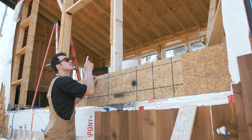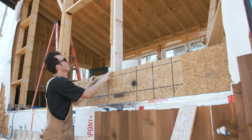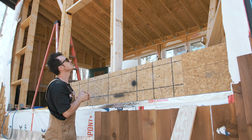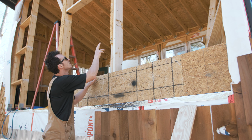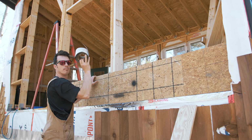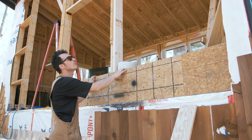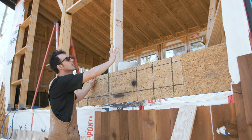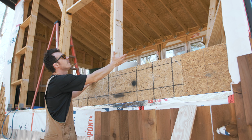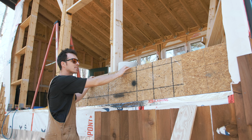All right, I need more 2x6s to continue framing out that portion of the wall. But this wall is pretty much good to go. I just gotta put a little bit more OSB on the front facing portion so everything's the same width or thickness. So what I can do now is get the OSB all trimmed out, or scabbed on, I guess you'd say, and then I can put my window flashing on for like the 10th time. As soon as I get the window flashing on, all I gotta do is put up my pressure treated exterior trim that is gonna keep all the windows in, and then this thing is ready for glass. So let's try and do that today so we can get some glass in this weekend. Woo!